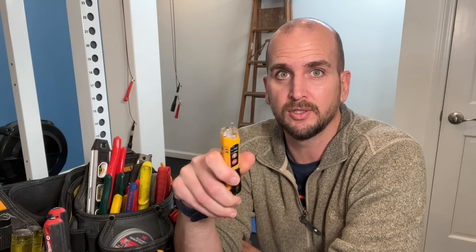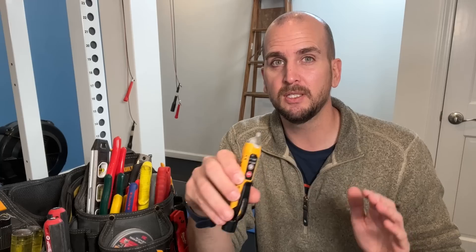That's something I've neglected to mention in the past and I'm happy to add — I appreciate everybody calling that out in the comments. So those are the three issues to be aware of when deciding whether to use a non-contact voltage tester as your main method. For me personally, this is still my go-to. It's extremely convenient and handy. I do use a multimeter, but most commonly for continuity checks — checking where wires are going or checking continuity across a switch. A lot of licensed professionals go straight to the multimeter for confidence.